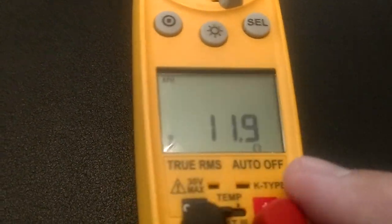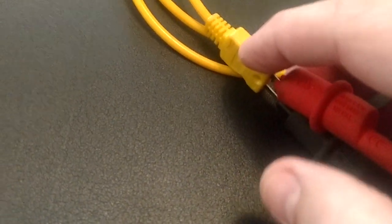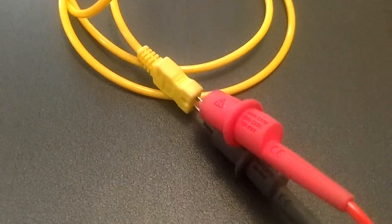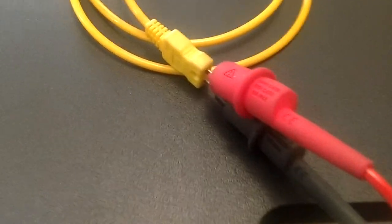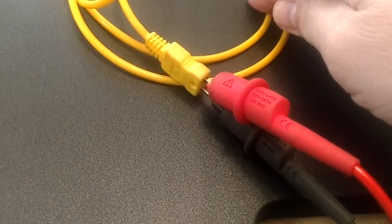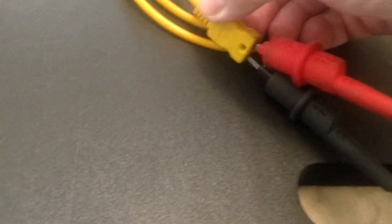So the reading that we're seeing on the meter is going to vary based on the temperature of that thermistor. And you have to have a little chart to do that. I've got a video that I made a while back. I think it's been a few years, but I'll try to put a link below here so you guys can check out that video if you want to. But you can find your temperature on your chart, and it'll give you what your ohm reading should be. And that way you know if your thermistor is accurate or not. These are not like that.